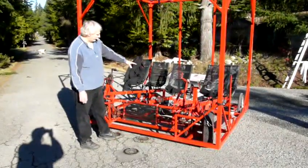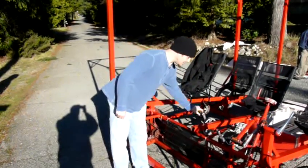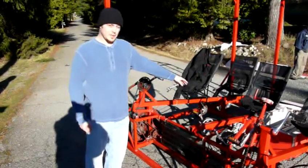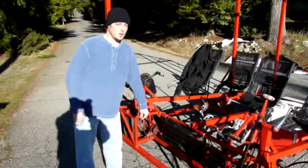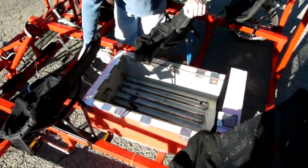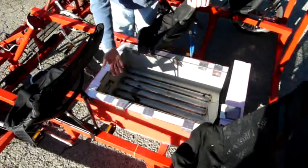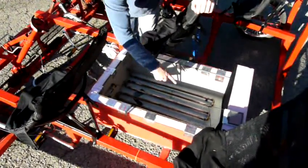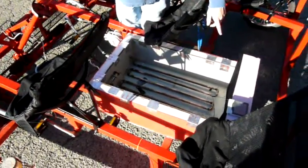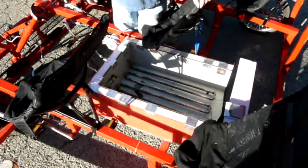The reason we call it the Ice Cube is we have a refrigerator aboard, possibly a freezer. For the cooling system, we started with the compressor — it came out of a car. We've attached it to a sprocket and chain drive; that's this system here, dedicated to that function. This evaporator coil came off the back of a home refrigerator. This is the expansion nozzle, and when you create high pressure, it forces the coolant through there. It expands through the little nozzle, and in this coil, the expansion process creates cooling, which sucks the heat out of this box here. In 10 or 20 minutes of steady pedaling, not at a real high rate, we were able to generate something like 20 degrees of cooling.